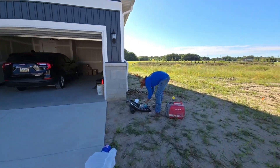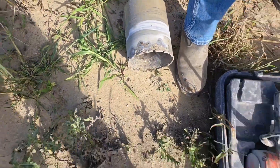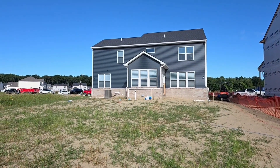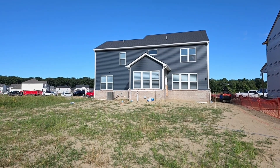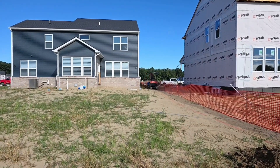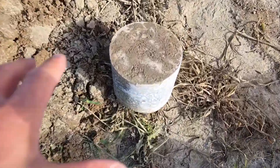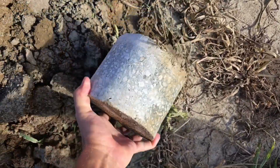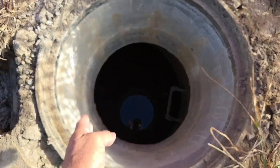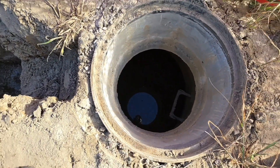For 2026, let's go. Patrick just core drilled with our six-inch core bit. We're running a whole house roof runoff system here. We're going to have a four-inch line come down this side of the house, another four-inch line come down that side, and they're going to merge right here to a six-inch main. Here's the six-inch core — the guys already cored the storm drain catch basin. This basin goes down vertical and then it tapers. They went through the sidewall — nice core.